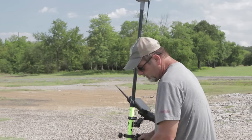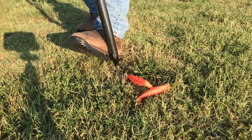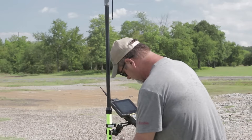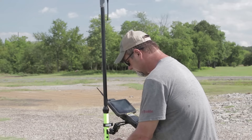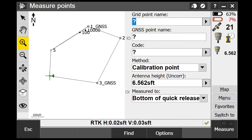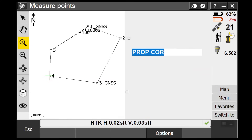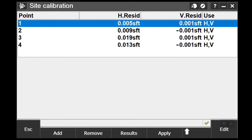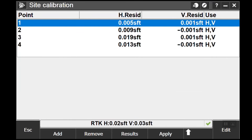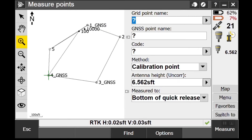Okay, here's number four. Let's stake out number four and see how close we are. Looking at the screen on the data collector, it's showing us we're sitting right on number four on the map. So I go to number four, hit Enter, say Measure, and store. Now we're starting to see more residuals — some vertical residuals appearing too. My vertical looks pretty tight so far; my horizontal is bouncing around a few thousandths to a hundredth. We'll apply that and head to number five.